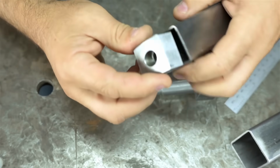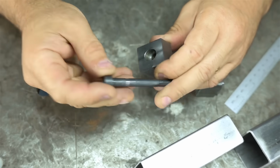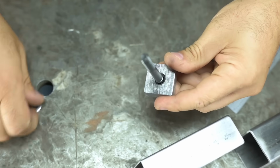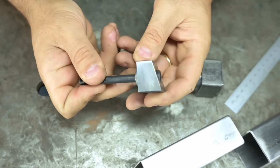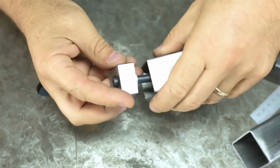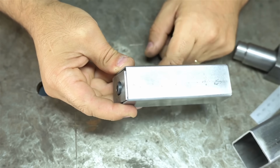This does fit into and weld to this smaller tube, and takes the socket head cap screw, which also got a small groove cut in it to take a snap ring. So that'll drop in there. Counterbore could have been a smidge deeper, but too late for that now. No sense crying over spilt coolant. And I think I'll drop a couple of washers on the back, and hopefully there's clearance to get a small snap ring in there. This will keep the screw captive with this cap part, with the top part. That will drag the smaller tube up and down. Now, one problem with that is that once this is all welded together, that snap ring will be inaccessible, unreachable. Not my smartest design decision, but probably one of my fastest.